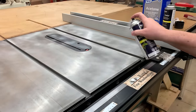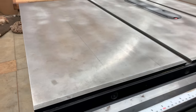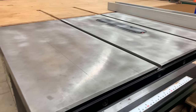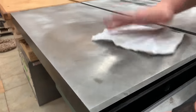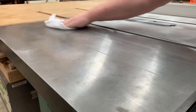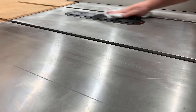I spray the glide coat right over the plastic throat plate and along the edge of my fence as well. Anywhere wood is going to be moving or sliding, we can even slide it over the wood portion of the outfeed. That's just going to decrease friction and make cutting easier. After that we let it sit until it dries a little bit, then buff it off. They recommend two coats, although I think that might be a marketing ploy — I've never found two coats feel any slicker than one, so I just put one.